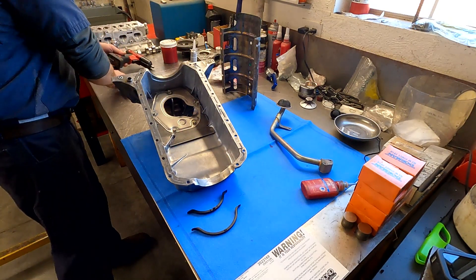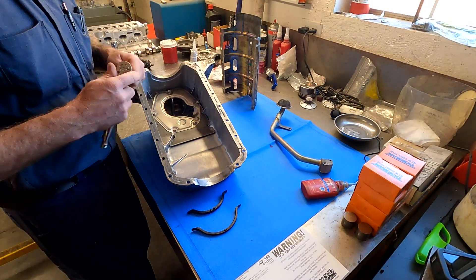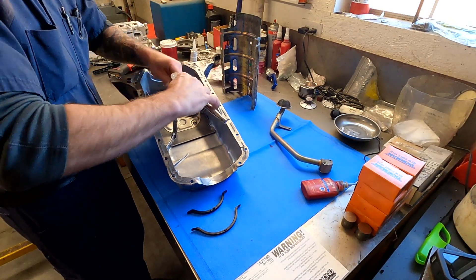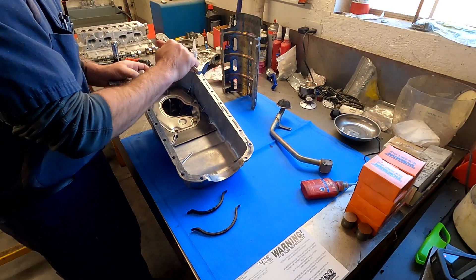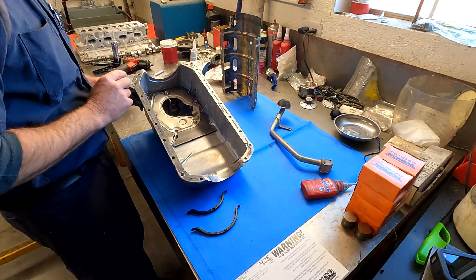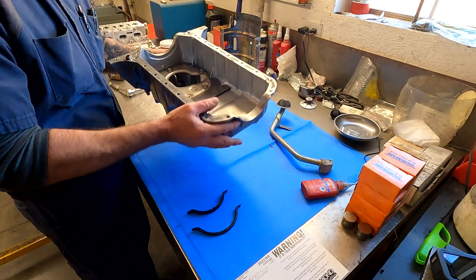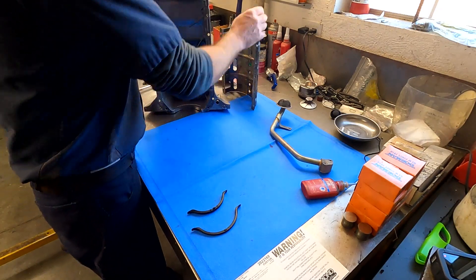As I go along, I use a little cordless impact to run the bolts up, then always use hand tools to finish tightening. The torque spec for something like this is about 10 or 11 foot pounds, which computes to about 125 inch pounds. You can see how it all fills in — there we have a really good oil pan ready to be installed.